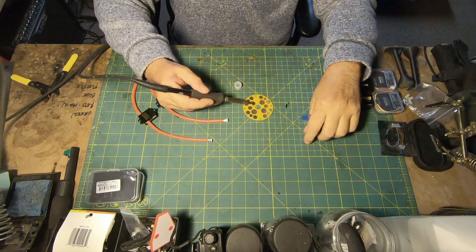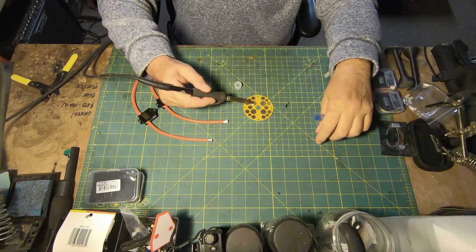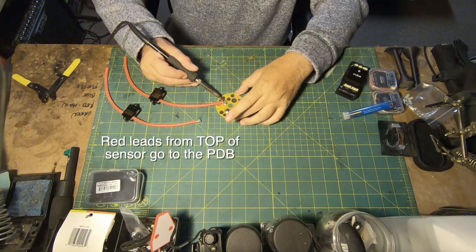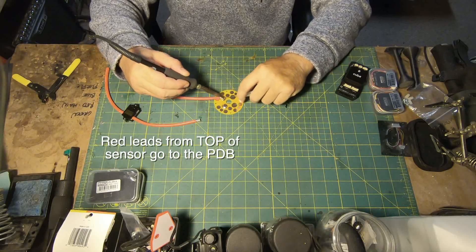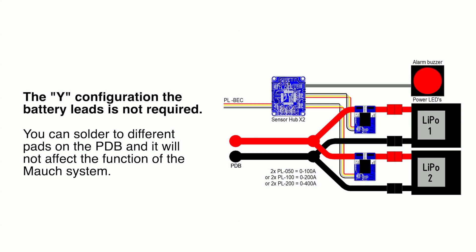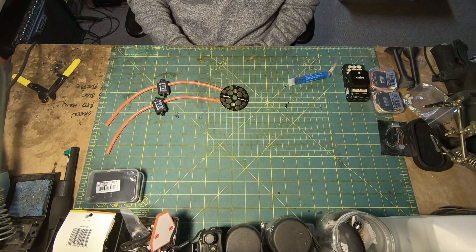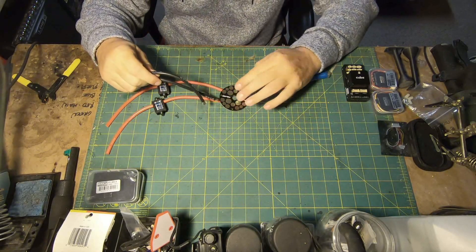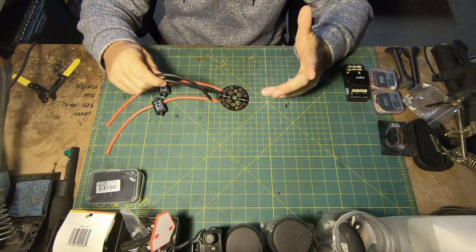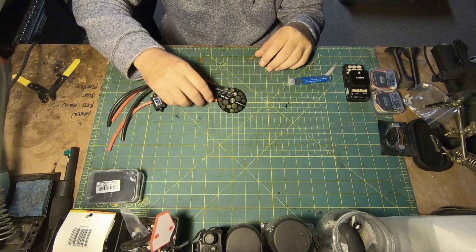Keep it nice and heated, and you'll see it's gone to the edges and formed this nice little bed. After you're done with that process for both of them, just flip it over, get to your negative side, and take the pre-cut ground lead and make sure you line them up with the two pads here. We're doing this so the XT60 leads will not be cockeyed. Just repeat the process.